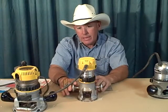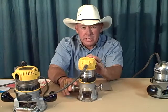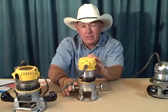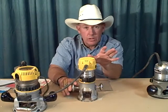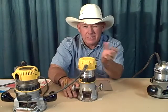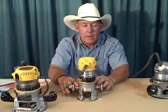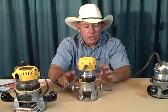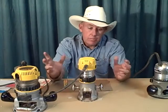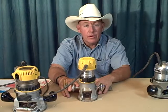Now, the bad thing about this is it's variable speed. So it says it cuts, I think, 37,000 at top speed. I don't know about that. I haven't checked it out to make sure. But keep it at top speed the whole time. Keep it on 6. That's your highest speed. And I think it says it cuts from 17 to 27,000 or 37,000. But keep it on your top speed. It'll work the best for you. But it's a great little router. And now that I'm used to it, I don't want to cut with any of these other routers. So that's just my little information for you on routers.